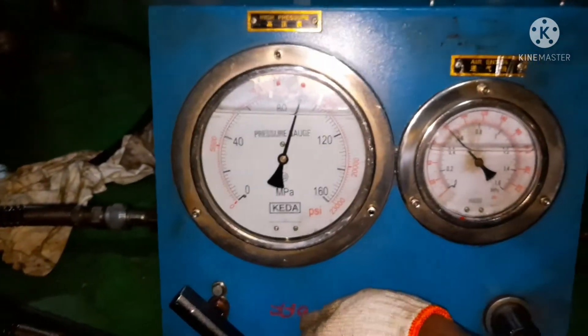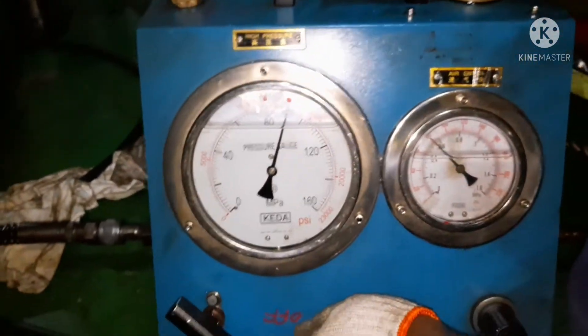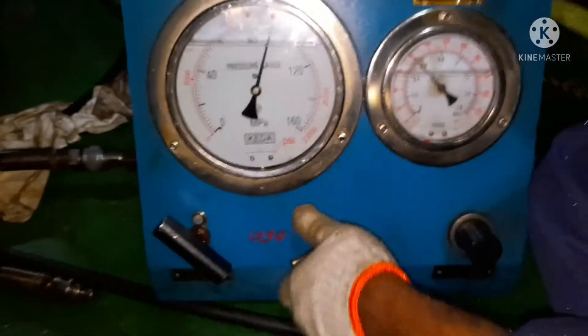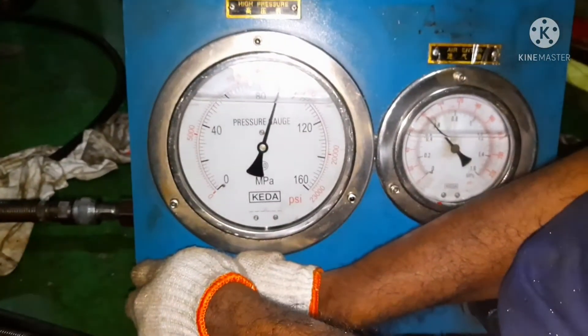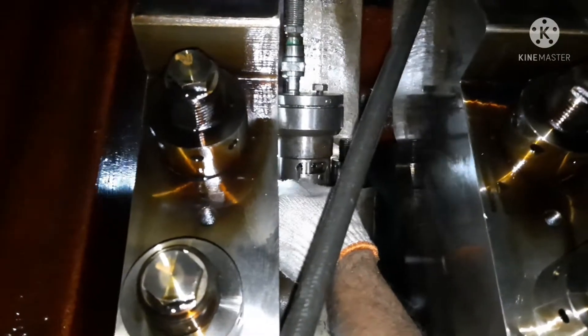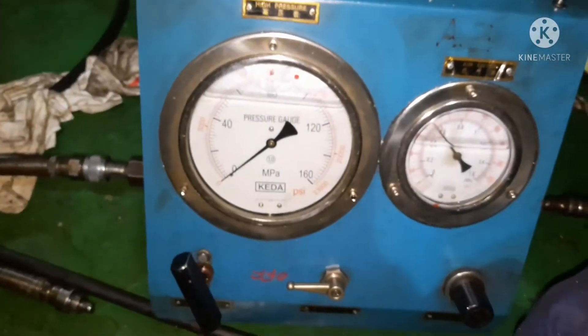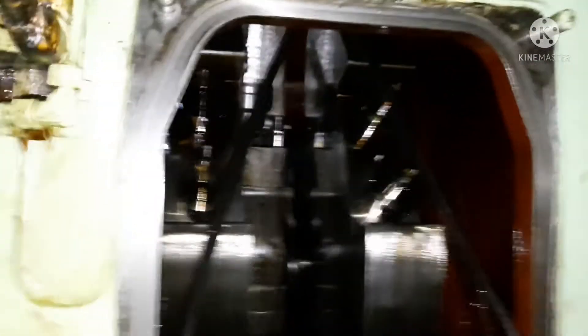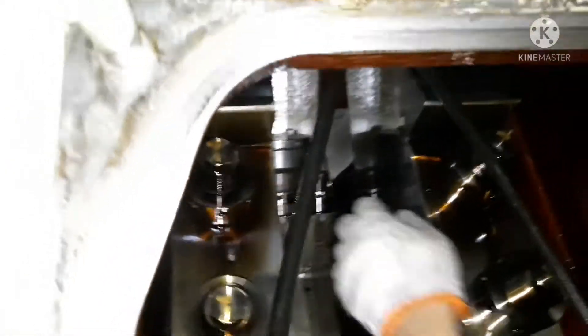Both sides have been opened. Now I can release the pressure — I stop the pump and release the pressure from the hydraulic pump. Close the pump and open the return line so that the pressure will drop on all lines and come back to the pump. In the meantime while the pressure is dropping, check whether the nut is still loose. Once done, remove the hose, open the jack, and fit the jack on the other two nuts.